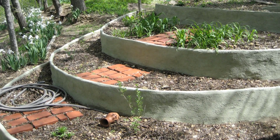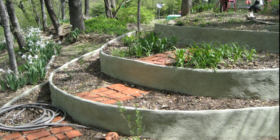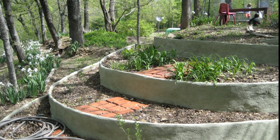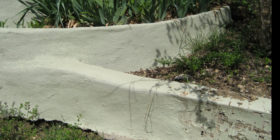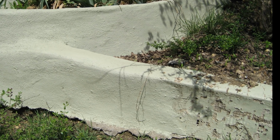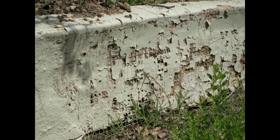It's crumbling. The reason I'm so sure that it's the sand which is failing is because another one of my neighbors did these beautiful terraced retaining walls holding back his landscaping, and when he worked through all of his bought construction grade concrete sand, he decided to finish up with some creek sand. And look at this transition right here. You can tell exactly where he ran out of the good sand and started using our local resource. And you can see where it starts spalling and falling apart. So that's my evidence for why sand is important and why I'm sensitive to low quality sand.